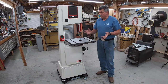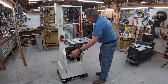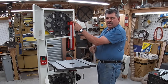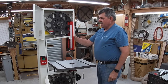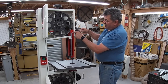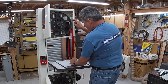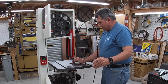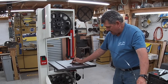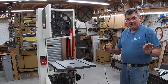In order to take the table off, I would suggest you remove the blade first. Open up the doors, raise up on that quick release, and you can see the blade is loose. Before you pull the blade off the saw, it can be tough to get it out of that guard — it's much easier to just lower the guard so that the blade lines up and comes out of that slot a lot easier. I've found that if you turn the blade 90 degrees and give it a little tug, it makes it a lot easier to bring it right out of that slot than trying to fight and maneuver it out.